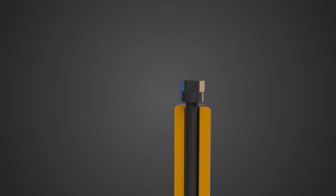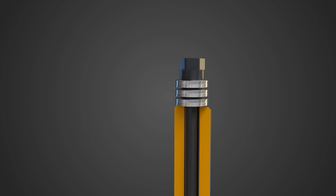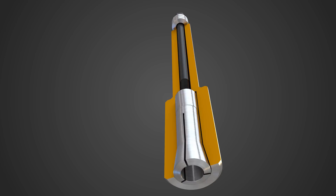We're going to be adding these special springs called Belleville washers. Now they don't look like much, but they can actually apply thousands of pounds of force. With these added, instead of unscrewing and screwing in the drawbar to take out a tool, we can just press it down. This does mean we'll have to find some way of pressing down with a few thousand pounds of force, but we'll get to that. Let's talk about these washers for a second, because they're actually pretty cool. You can get them in a bunch of sizes and spring rates to suit your needs, and they're not too expensive.